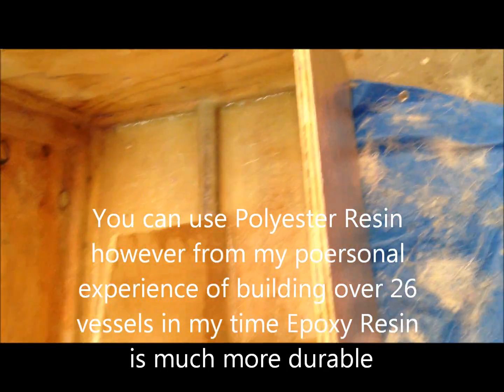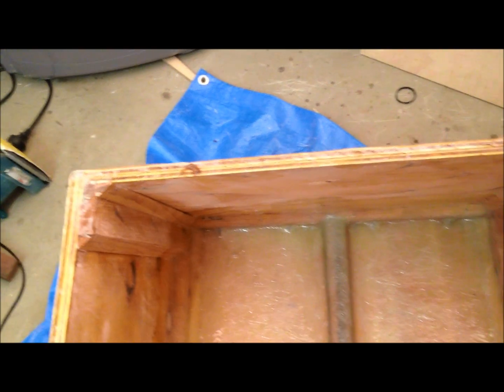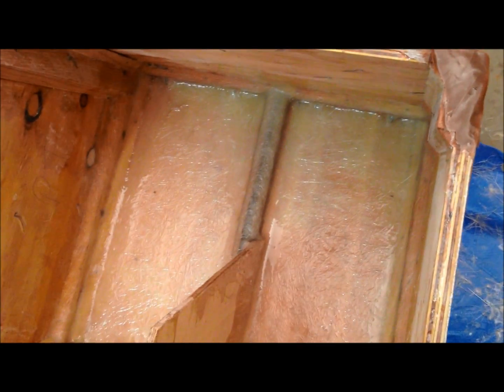On the sides I've got two layers of 9mm — port side there, starboard side here, against the stern — again two sheets of 9mm ply. You can see I've got a framework in there as well, and I have fibreglassed the inside at the base, at the bottom of the hull. I will be fibreglassing the rest of it on the inside as well, to two thicknesses — two layers of fibreglass and two layers in the corners.